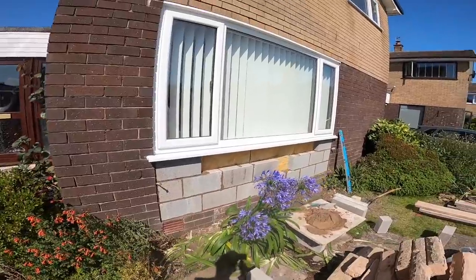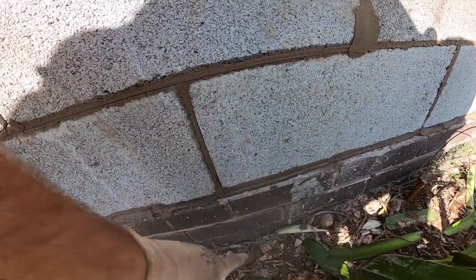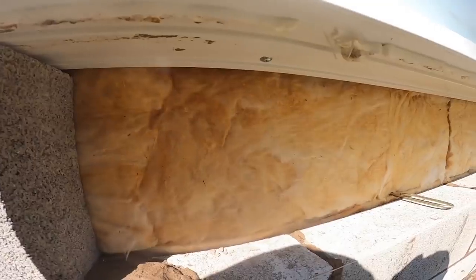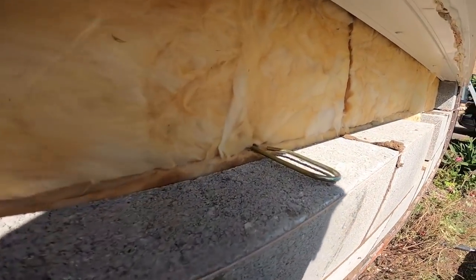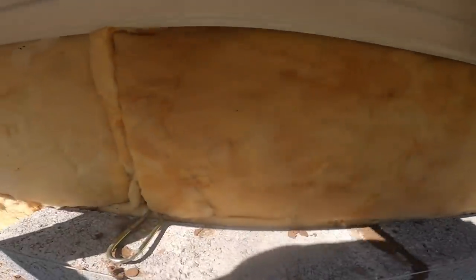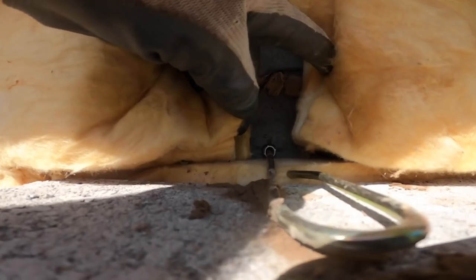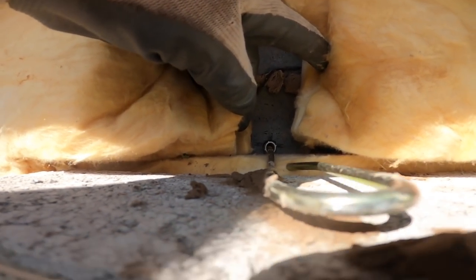And my side, I'm nearly done. I've got a piece in the middle of mine. And I put tie wires bent in half into a V on the damp course across. We both did that actually to stop the insulation dropping down. There's our insulation, 50 mil, and there's the ties. So got a tie in there with the liners, and there, one there, and one there. And I'll just show this one. As you can see, that's quite clearly running down,